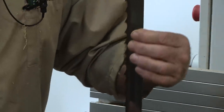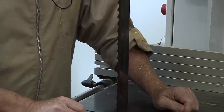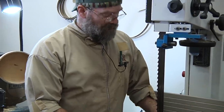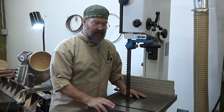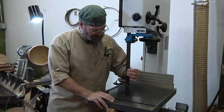It just saves time, saves money. It's not going to give you a pretty cut — it'll give you a good cut for resawing. I was thinking about a carbide tip blade, and the blade maker said no, you don't want carbide tip blades unless you're cutting fine veneers. I had to try one out anyway, and it cost me about 180 bucks. Found out it works way better for veneers than for cutting through logs, and it doesn't really stay sharp any longer than the bi-metal blades.